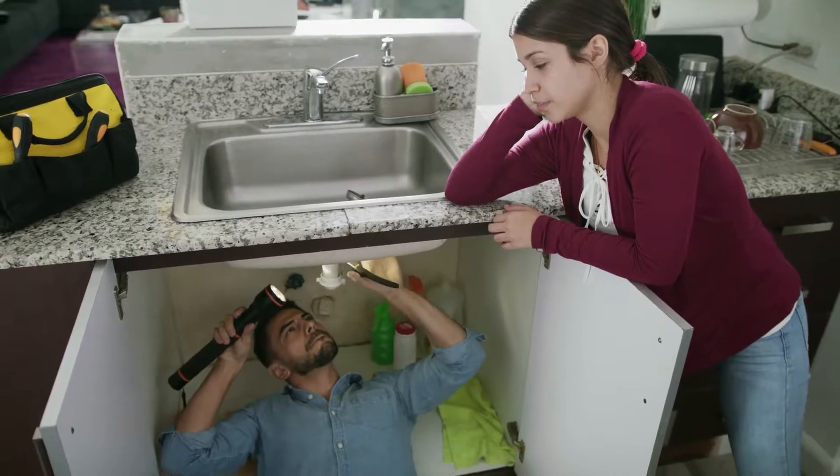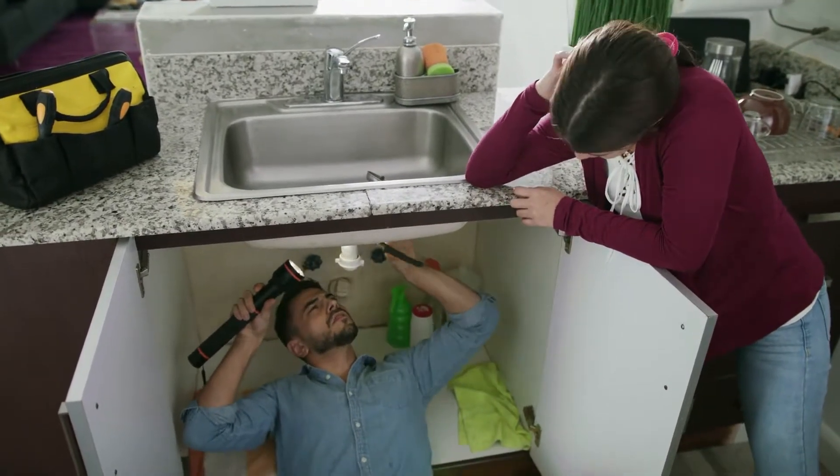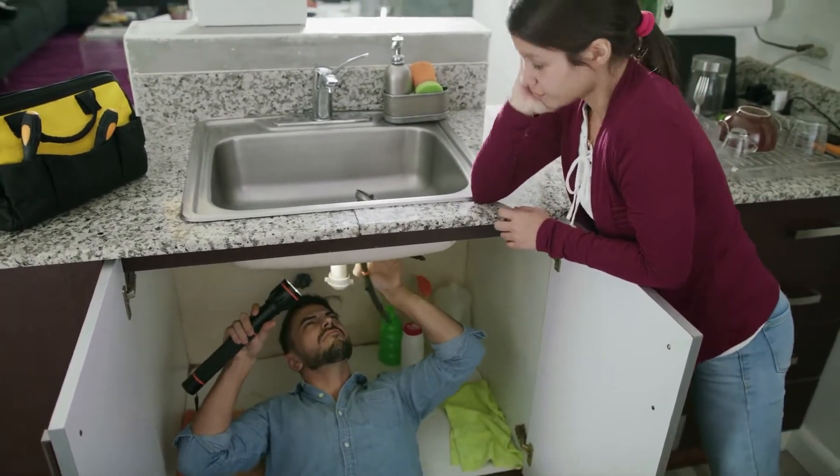Fixture specific: If one or two of your faucets are not performing as they should, you may be looking at clogged aerators. Get a handle on this by unscrewing the fixture nozzle, checking for buildup, and soaking gunky pieces in vinegar water overnight. If the pressure is normal while the aerator is off, then you have likely found the problem. If soaking the pieces in the vinegar water solution doesn't increase the pressure, you may just need to buy replacements at your local hardware store.